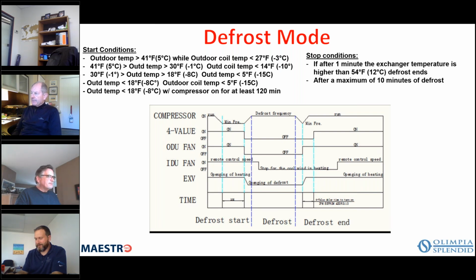When you wire that, let's say you put an occupancy sensor in the room, Jack, and you wire it in, and you walk in, the occupancy sensor closes. That allows you then to power the unit on with the remote control? Yeah, it allows you to power it on with the remote or the keypad on the unit itself, either one. Okay. So if the unit's on and you leave the room, then the unit will shut off. Is that the case? Correct.